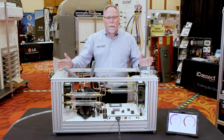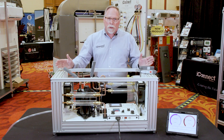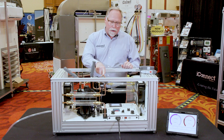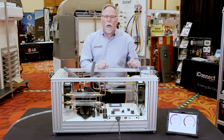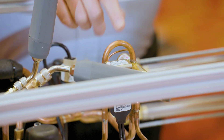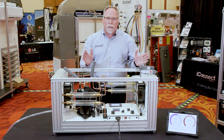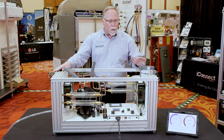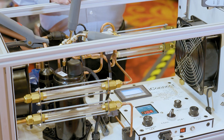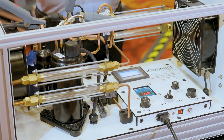So with this you have a complete kit. We can also switch it from heating to cooling. We have a reversing valve here and a controller where we manually control it from heating to cooling. The students can also see how the refrigerant pressures change from one coil to the next, and you can also show them how loading up that compressor will affect how the heating change affects it as well.